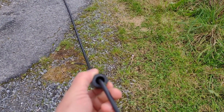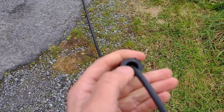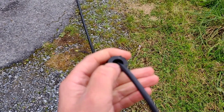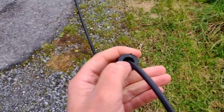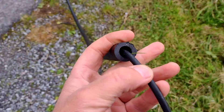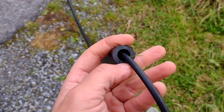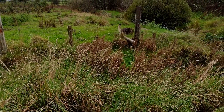...just on the entrance, spray a little bit of silicone or a little bit of wax — they sell shoe polish — and then just push the cable through. Chamfer the end first, and then just push it through. It will glide through.